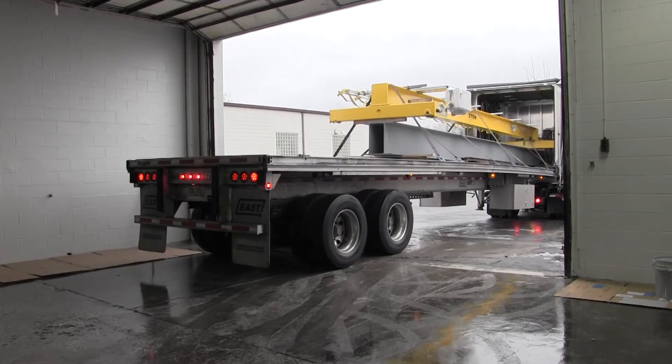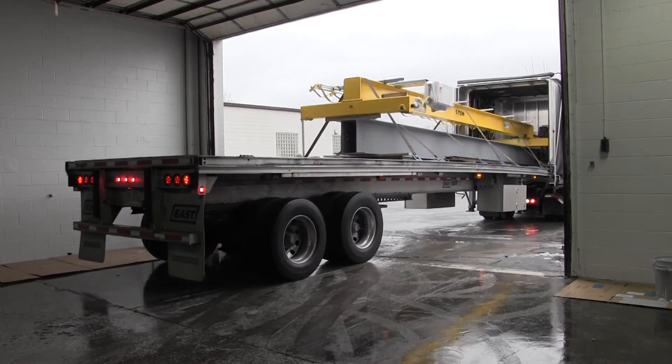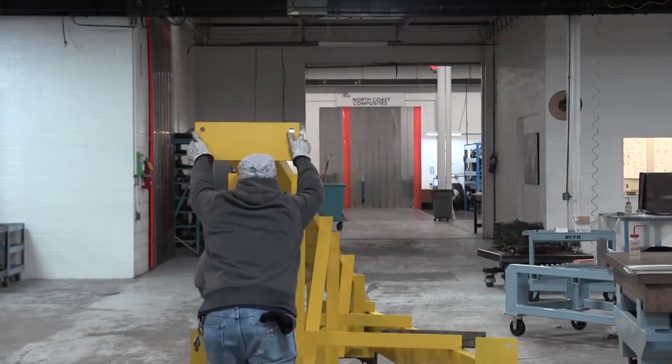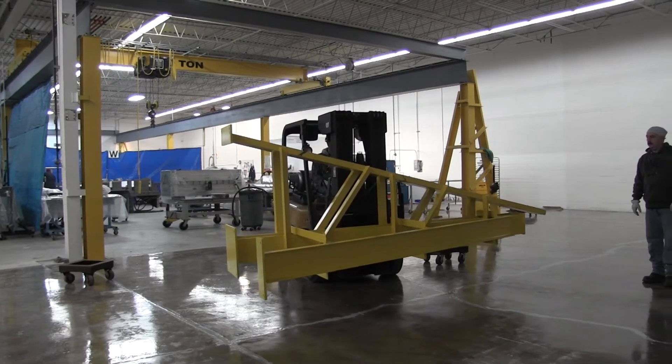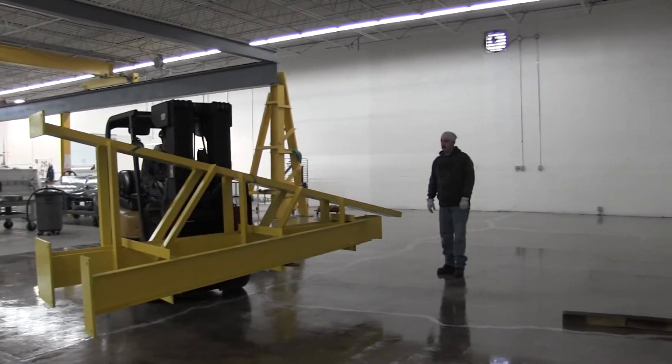One of the main things Chris kept talking about is free and clear access. That's important because if people can't get the crane into your building, you're not going to get your overhead crane. We need to have access to the receiving dock where the crane is going to be delivered, as well as free and clear access to move the crane through the plant and in the area where it's being put up. That allows our guys to move their equipment around so they can put this crane up quickly and efficiently.